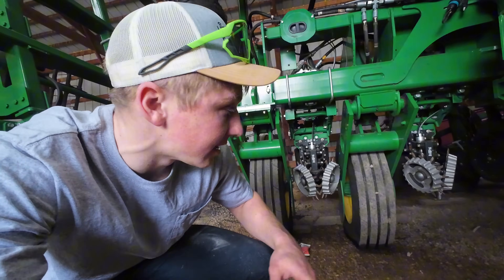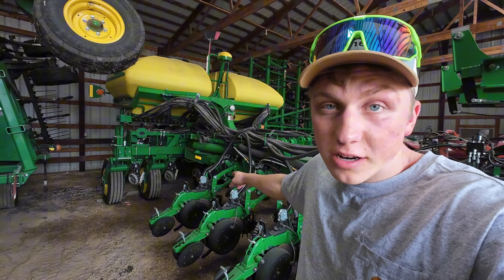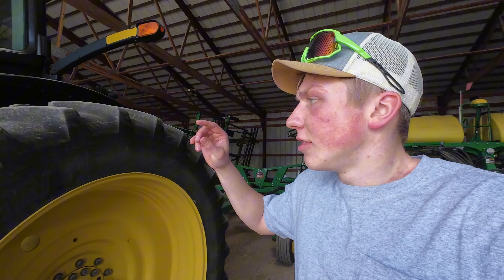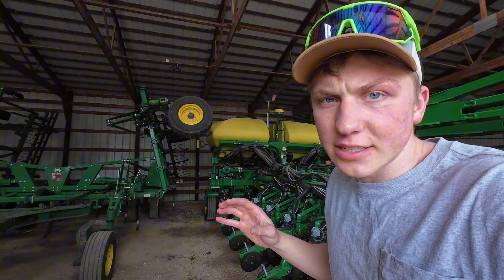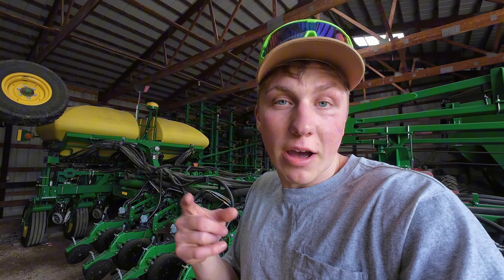That means we have rows one, two, three, four on one side of the tire, and five and six on the other side — a total of six rows that run right next to the main duals of the tractor. Those six rows all run right next to the big heavy duals that hold most of the weight, and that's important because there's a lot of compaction from that load. Before the CTIS system we weren't able to change the pressure in the field and raise it back up for the road, but now we're able to decrease the pressure and make a wider footprint with the tire.